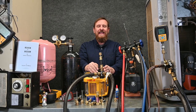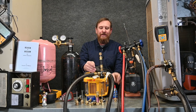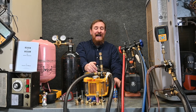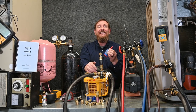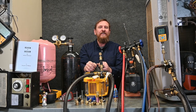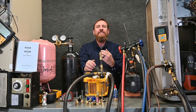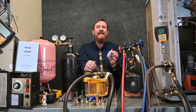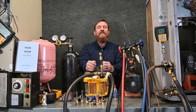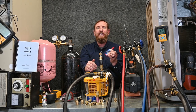You also want to make sure your connections are good. I started using a product several years ago called Nylog, and Nylog is great between all of these different connections — it helps seal that connection. I have no affiliation with this company; I just love their product because I personally used it. This product makes a seal between all the connections and it lasts much longer. I used to replace all my O-rings very often, and after using this product I don't have to replace them nearly as much — so it's saving me money.